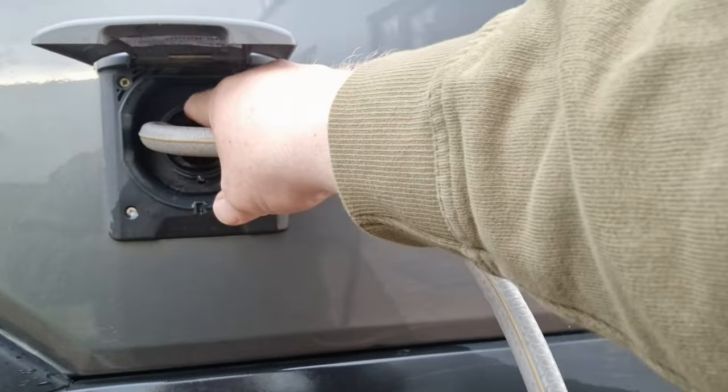I'm actually having to hold the hose pipe in — I lost the connector bit that plugs onto the end of the hose. It's a brilliant piece of kit normally — you just plug it on, go about your business and come back when you hear it gurgling. We've got a full tank of fresh water now, so I'm going to pull it through the system until the water doesn't feel slippy anymore.